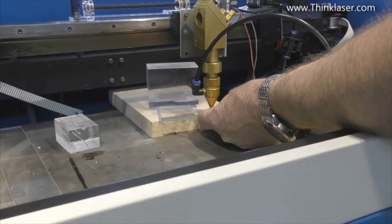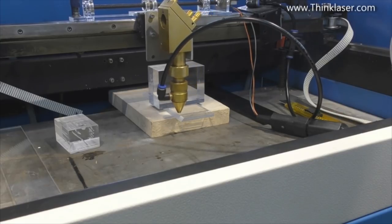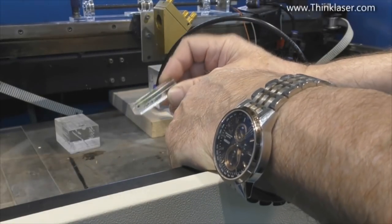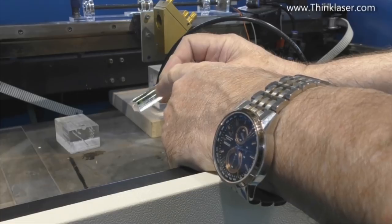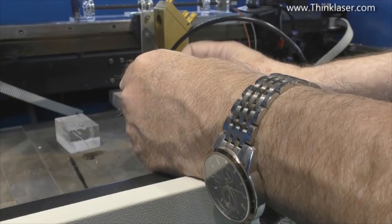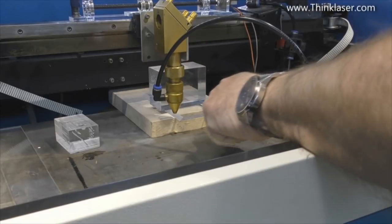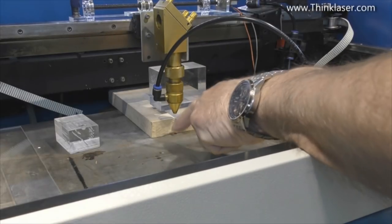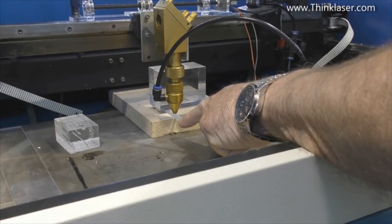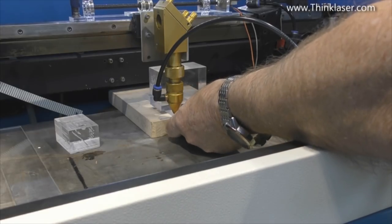That's a little bit unexpected, but I would say that's probably slightly better with air assist than without. We'll catch that in some sunlight so you can compare the difference. I've got the power set as high as I can to try to get as much heat as possible into the cut. Remember: if we can keep heat in the cut we shall have a liquid film in there which heals the surface over and helps cure any striations.